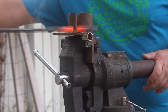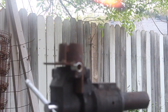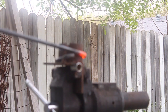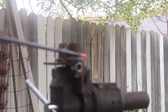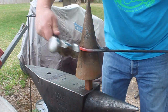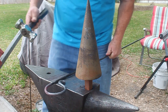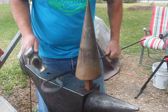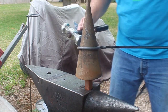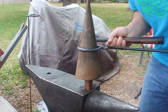I made this jig — well, I didn't make it myself, a friend made the jig for me because I don't have a welder. Get that out, get that starting to get it round. Got to heat it up again, get the last bit. There it goes. Off camera I'll go up and flatten it off on the anvil. There's a cone mandrel I purchased — it's easier to get your things round instead of using the horn, because the horn is not round. The cone mandrel is an equal taper all the way from the bottom to the top.